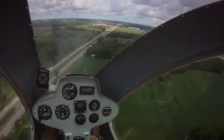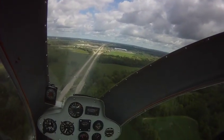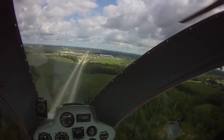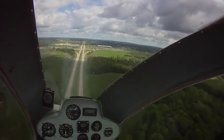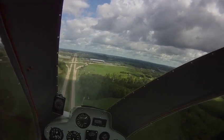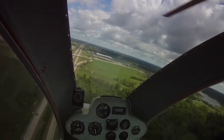You can look at the Red Lion digital gauge there — it pretty much holds 61,675 to 61,750 RPM, never more than 100 RPM variation. If you think about that — that thing is spinning at 61,700 RPM and able to hold within 100 RPM even though I'm making changes in collective and pedal. That's quite amazing.